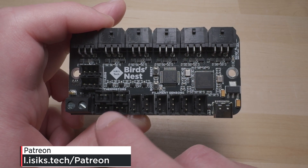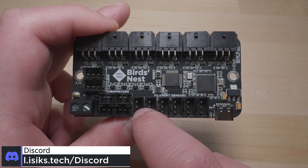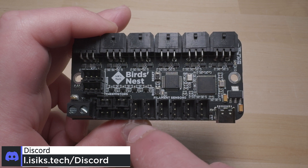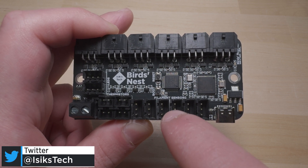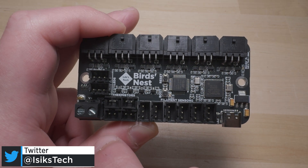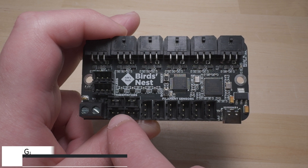You can see the status of filament in Klipper that way. If you have filament sensors on each of your spools for each of your tool heads, you can see their status through here. You don't have to run a separate control board just to read the filament sensors, which will likely be closer to your spools than the electronics chamber of the Voron 2.4.